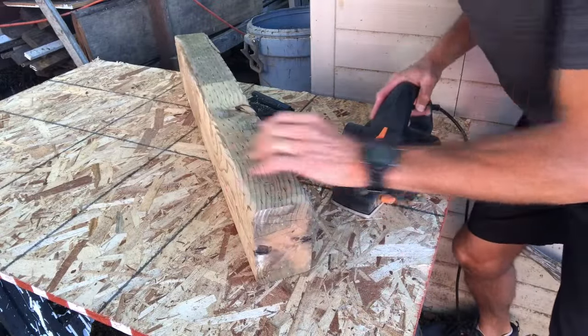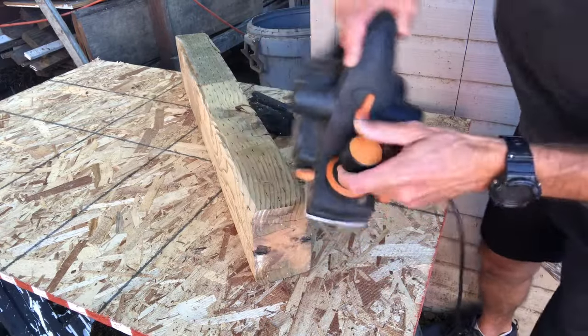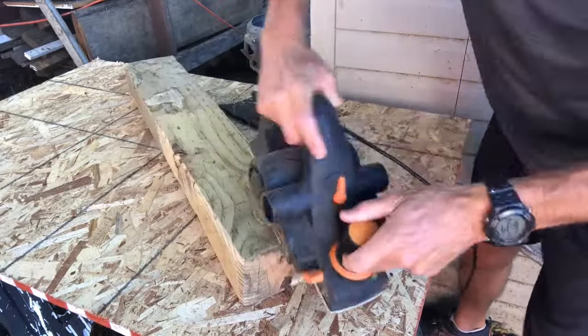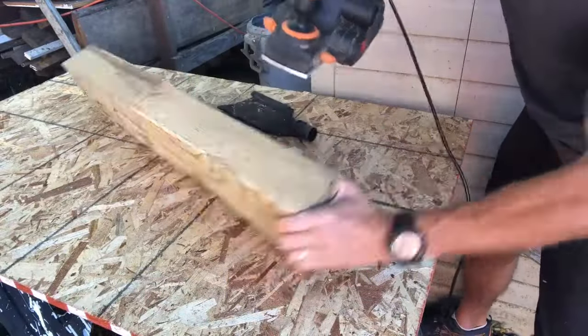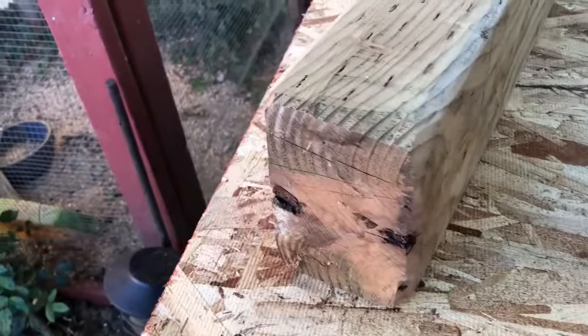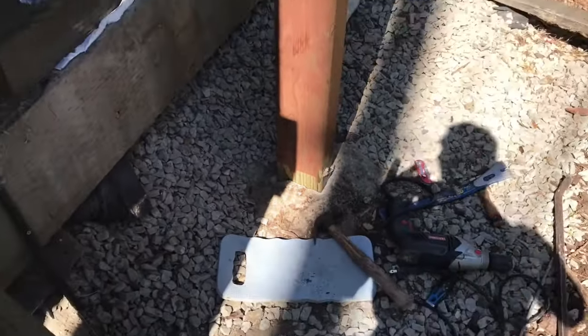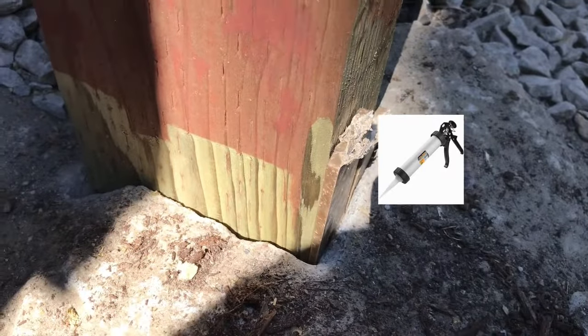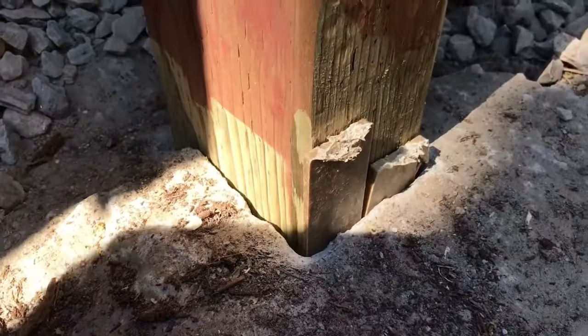Here's a quick demonstration. It goes very quickly, especially at four times speed. Here's a close-up of the finished post right before installation. Here's the actual post I slid in — this one was slightly loose, so I used shims made of Trex plastic material, pounded in with a hammer. You could also use some caulking around the gap to prevent water from getting in and to help it hold more snug.